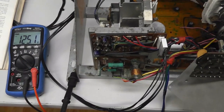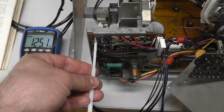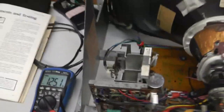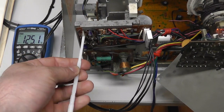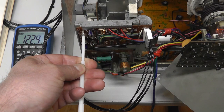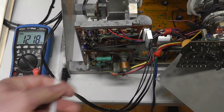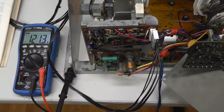Let me get both in here real quick. Isn't that crazy? Okay, so the B plus voltage rises when I turn it clockwise, but the screen is blank. It's dim, right? And if I turn up the brightness, which doesn't make sense that it's counterclockwise, B plus voltage goes down. And that's full screen. It's retrace lines and everything. Doesn't that totally not make sense?